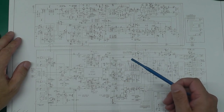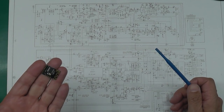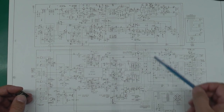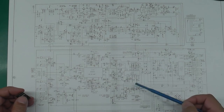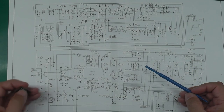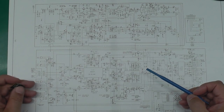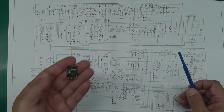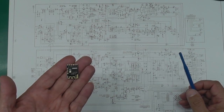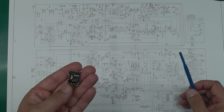The other problem is powering the Bluetooth module. This unit runs off 5 volts, and I doubt there's a 5V DC supply on the board, so I'm going to have to pick up something a bit bigger and add a 5-volt regulator alongside it. However, this all depends on whether the Bluetooth module can do the job, so I'll hook it up offline first and give it a test.